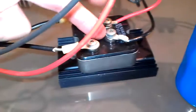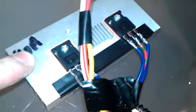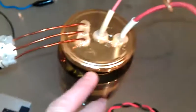It goes out into two of these capacitors — that's the spec of the capacitors there. AC into rectifier DC, which basically cleans the voltage, makes it nice and stable into a DC capacitor, and then into a ZVS driver. The transistors are IRFP260s. And then from the ZVS into these capacitors and into the flyback.